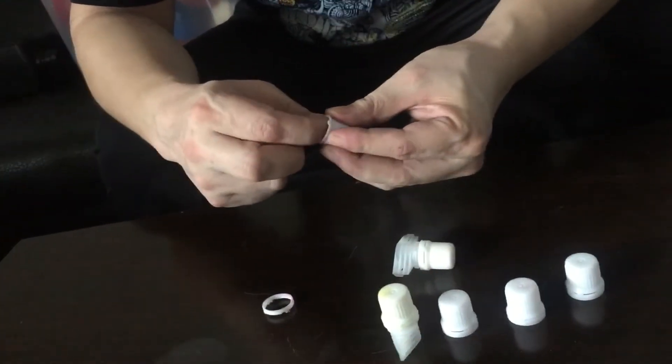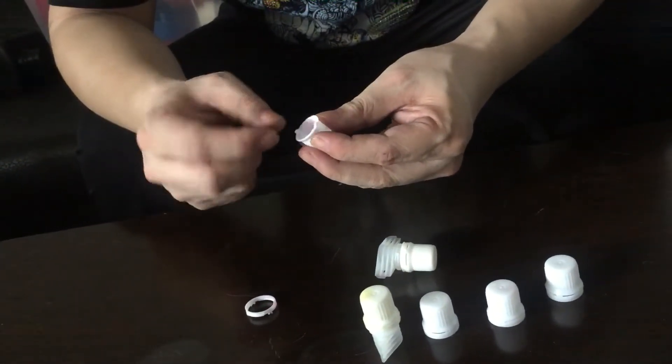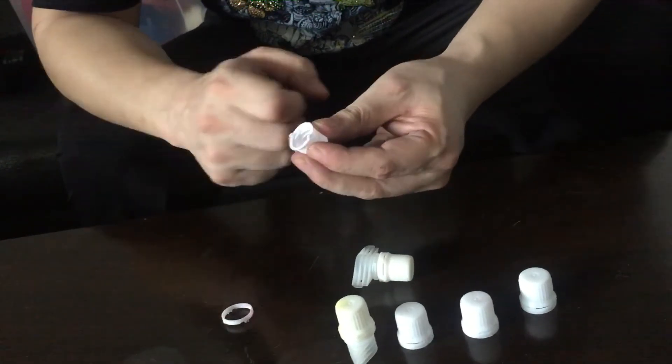Another point: if the thread is not so deep, there will be no need for an unscrew system. But now the thread is deeper, so it needs an unscrew mode system.